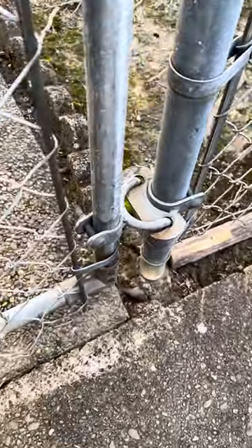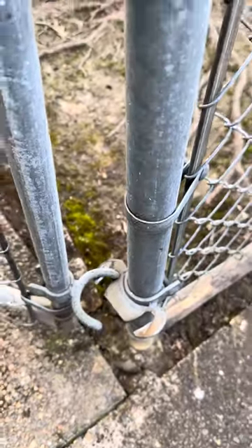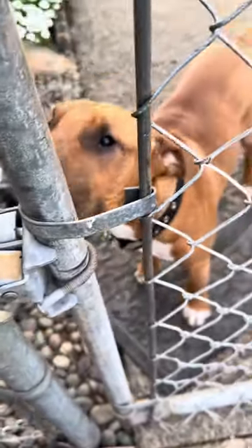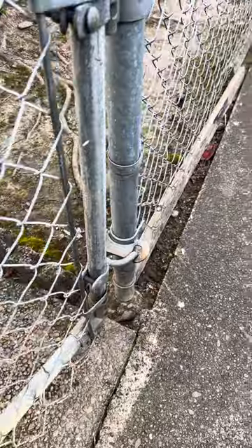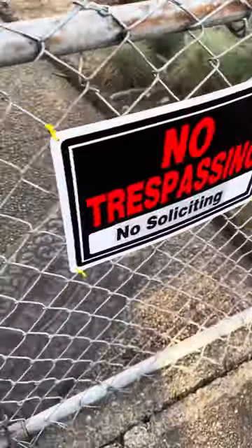What this does is, as you open the gate, it rotates into this pin area, and you'll see the gate is on somewhat of a lean. The butterfly latch is designed to close both directions, so you can open this either way. You can see this coming out, and the angle of the gate — it's not vertical anymore — so that'll give a pitch when it wants to close by itself.